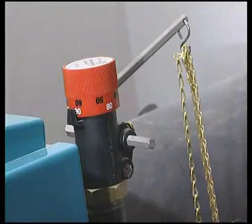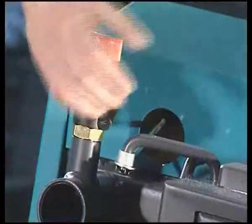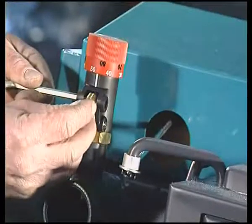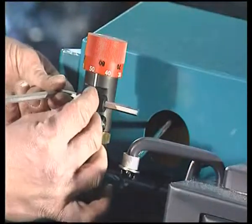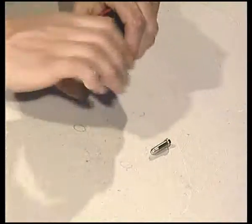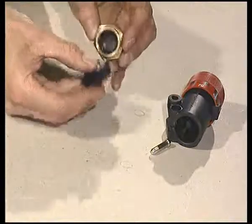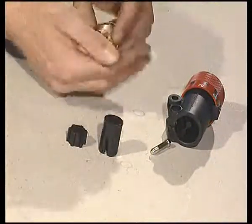The power output regulation is very important for boiler operation. The FR124 regulator is located on the boiler water outlet and controls the amount of air entering the boiler based on the water temperature exiting the boiler. If the boiler overheats, the regulator insert can be damaged. The insert can be replaced by loosening the securing bolt and removing the plastic part, then removing and replacing the insert.